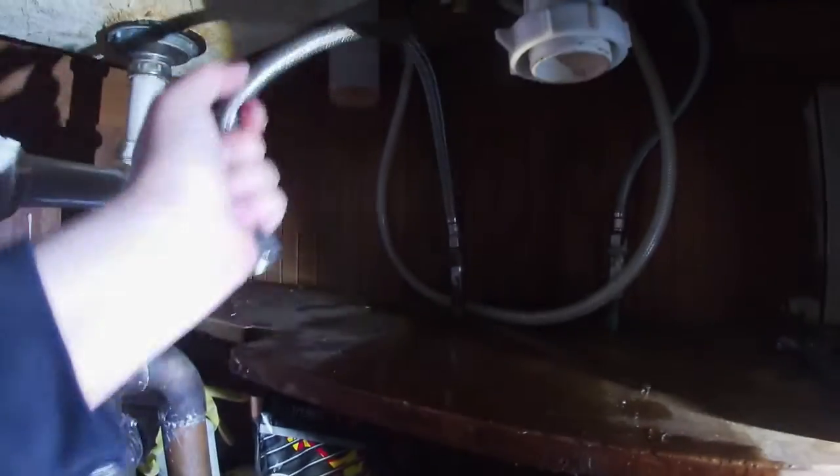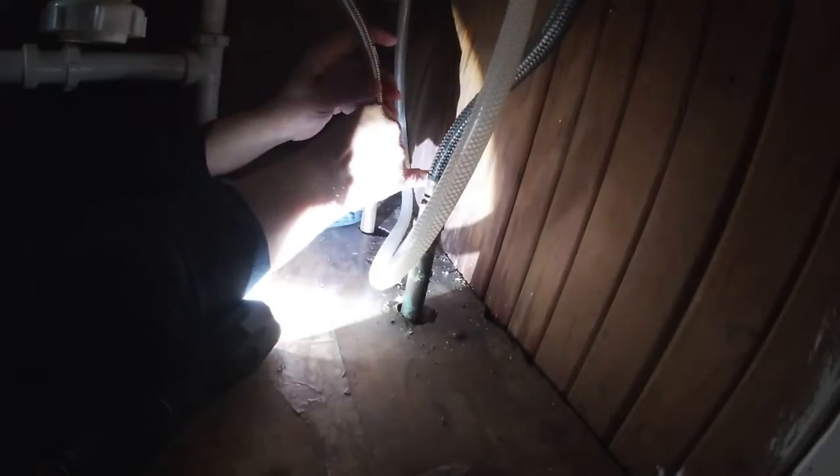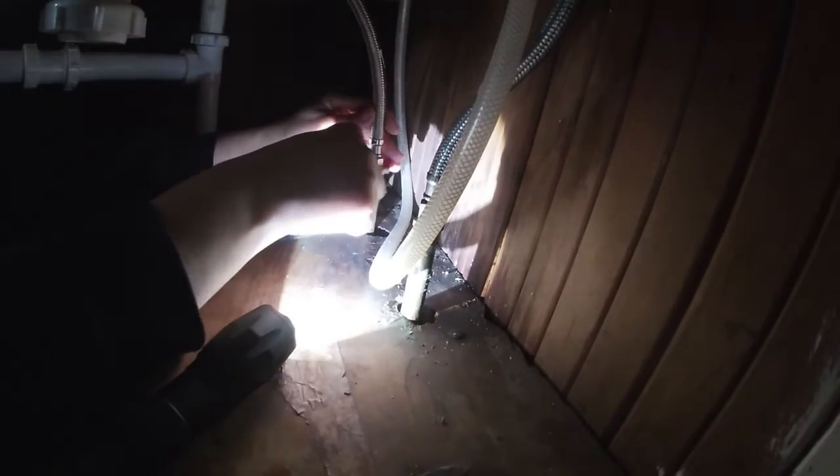That's why this has been leaking — I have my bucket catching the water. This old flex pipe is way, way too much. The new one has new gaskets in there; I made sure they were in before I bought it. Let me clean the fittings off really well — I've got some corrosion going on. I know I'm going to kick myself for not putting tape on — that's how my father taught me.